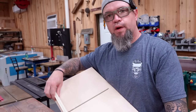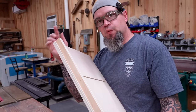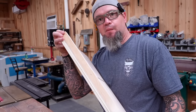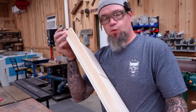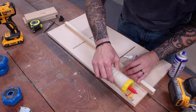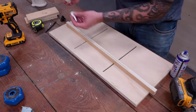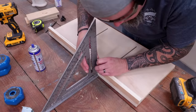Now we're ready for that one inch strip and we're going to attach it to the outside edge. One thing we need to make sure of is that it does not stick out past this edge — it needs to be perfectly square with the baseboard so that it will be perfectly square with the fence. To attach this backboard to the base I'm going to use some wood glue and also some CA glue just to speed things up a little bit.